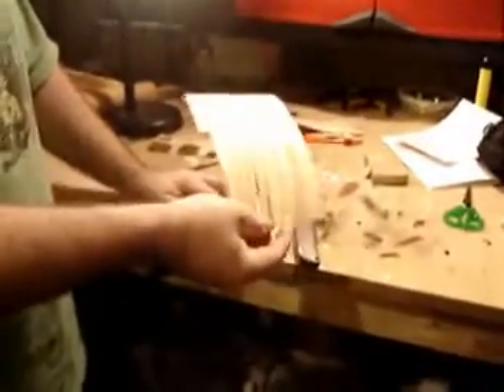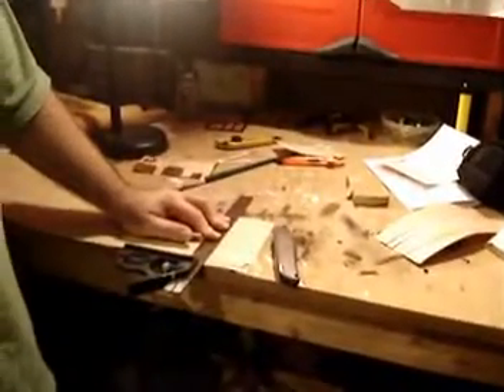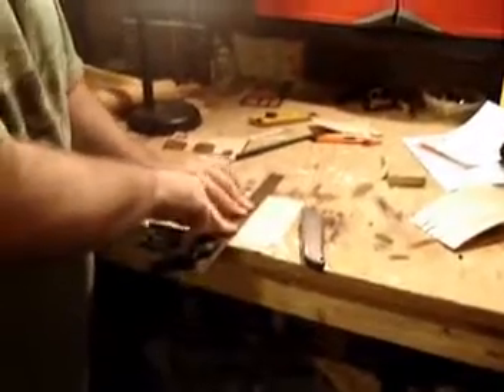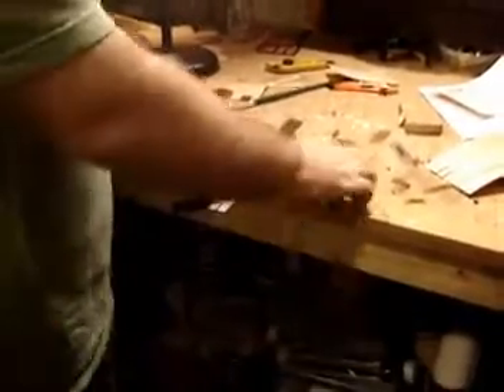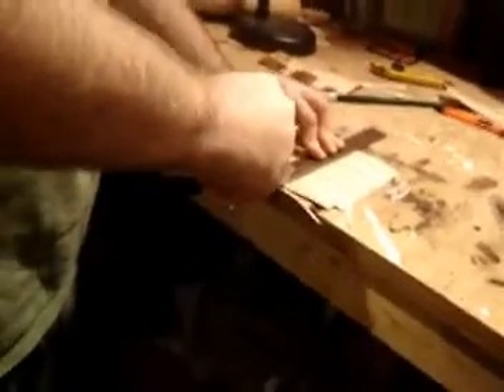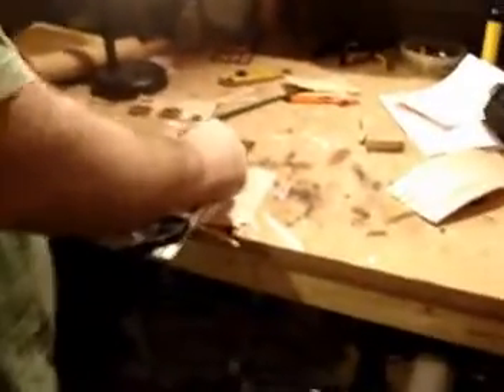Working with veneer isn't really hard, but it is tricky. Veneer tends to rip along its long axis like that — it actually doesn't take much to rip it at all. So we want to see if we can get this cut and trimmed up without splitting it. I'm going to put it on my bench with a T-square to protect the inside edge. When you're actually trying to cut veneer, you don't try to muscle your way through it. You use a nice sharp utility knife and you score it over and over again.